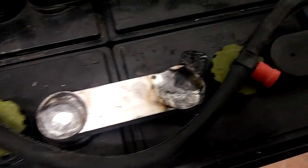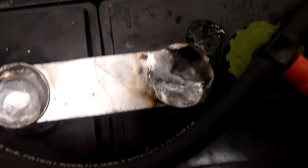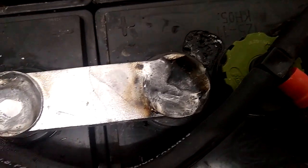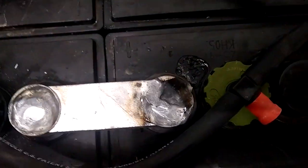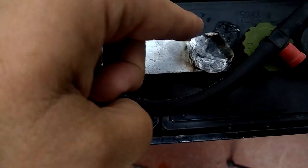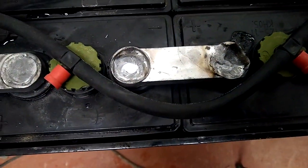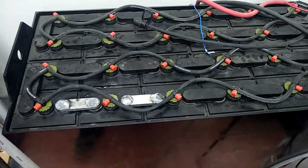And unfortunately, I did the one thing that I was told to make sure I don't do, and that is get too close to the edge of the interconnect here, this little metal bar. It's got that loop around it, and I melted the edge of the interconnect off, but still making contact all the way around. And of course, this part right here is the most crucial, because that's where the current's going to be carried. And you know, we're only at most going to be drawing about 100 amps off this thing,